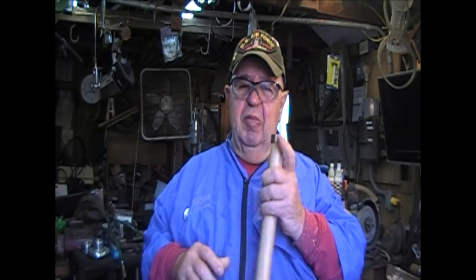Then I'm going to take my drill bit and re-drill that center to be at least 3 inches deep for a round bar. I've got the bar around here someplace. I'm going to knock the corners off a little bit with a belt sander, put the epoxy in there. I like that 15-minute epoxy you can get from Penn State Industries. It's very versatile. It doesn't work so fast you'll be scared to get done with it. And it sets up really nice. It's a good product. Don't get the 5-minute. There's no win there. You're not going to use this till tomorrow anyway.